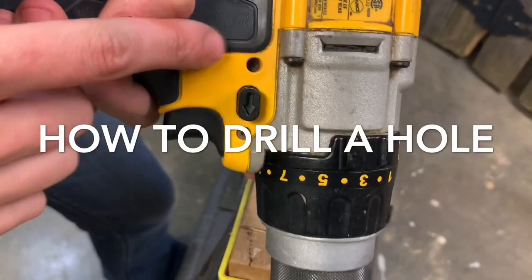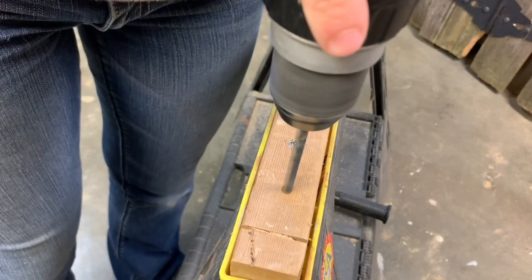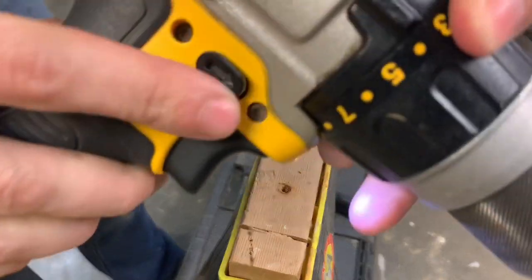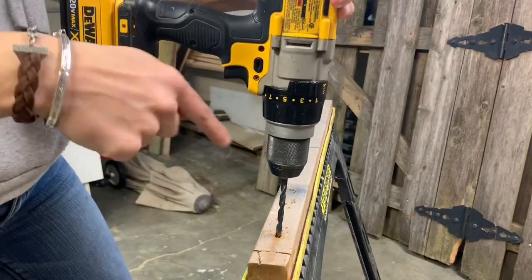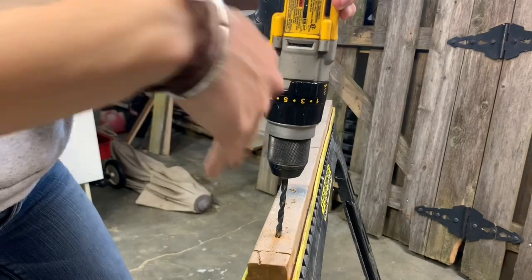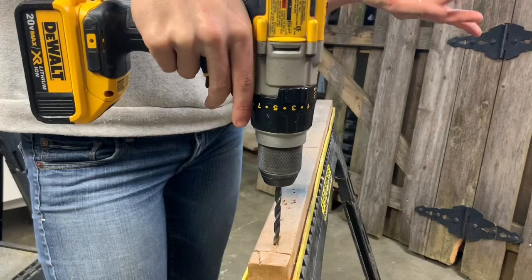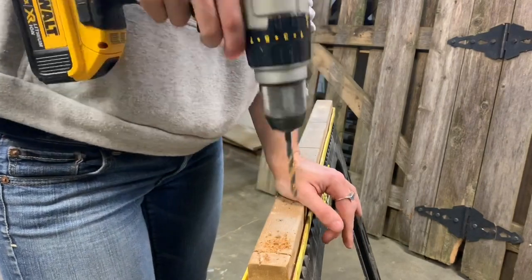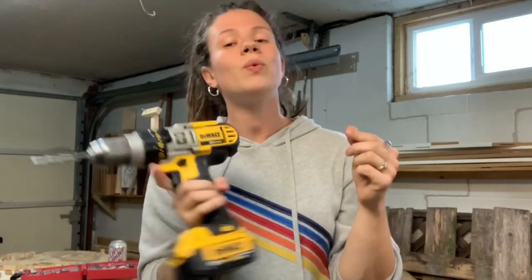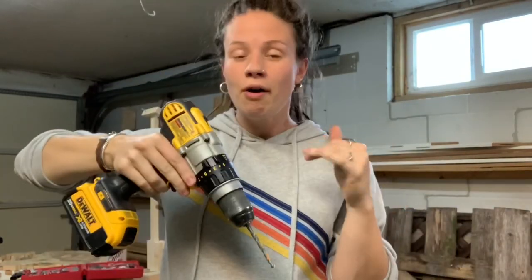When you're ready to drill, make sure your forward arrow is pushed in. If it isn't, the bit will just spin and not bite into the wood — it'll smoke and could start a fire. Hold the drill straight both up-and-down and side-to-side so the path is completely straight and won't split out the side of your material. It's easiest to start with just a little pressure on the trigger, then gradually pull tighter once you're in the right spot. For shallow holes you can just pull the drill back out; if it's stuck, throw it in reverse and it will back itself out.